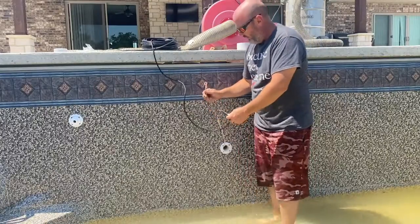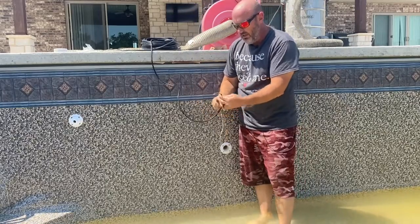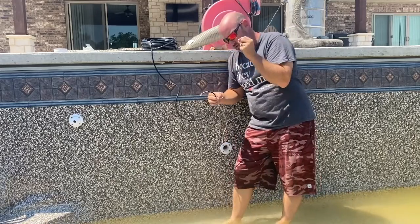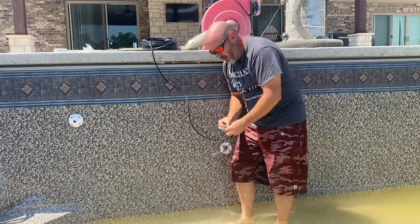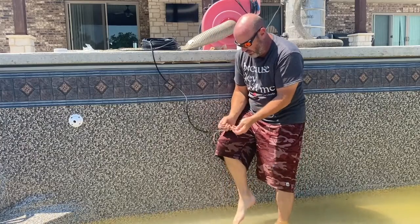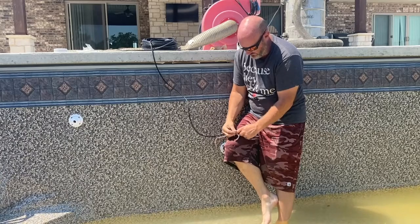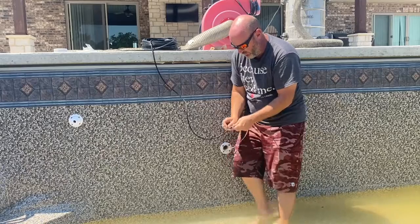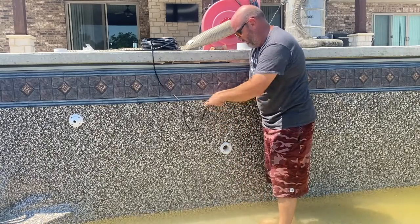Okay guys, so you've got your string pulled through from the equipment room where the conduit comes above grade. And these wires here, the Microbrites come with either 50, 100, or 150 feet of line. You've got to kind of gauge that. Most of our kits just come with the 100-foot variety unless you specify otherwise. The 50s are hard to get right now, and 150s are always hard to get. So if 100 feet gets you to at least a point where you can junction, then we recommend just sticking with the 100s because they're easier to come by.